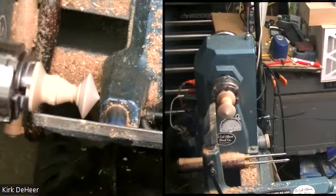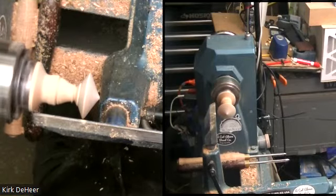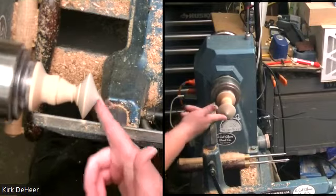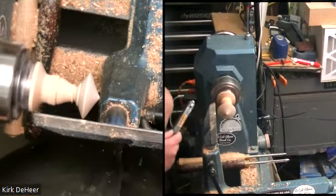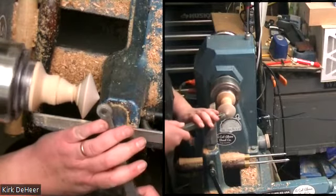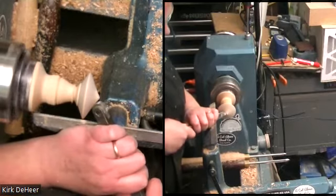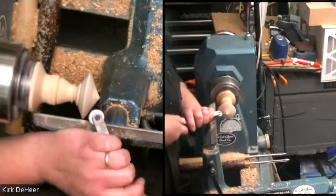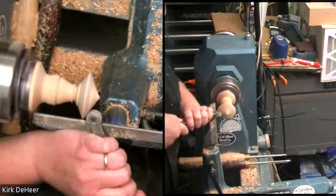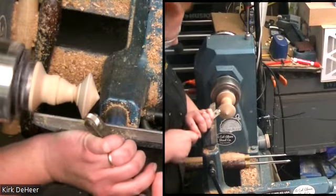I love the Wagner texture tool — I can do almost anything with this tool. We're going to speed up just a little bit to about 400 RPM to use this tool. 400 is extremely slow to me. The really cool thing with this is depending on how you hold the tool you'll get different texture variations. Depending on the angle you're holding the tool at, you'll get different texture and different patterns — and that's lots of fun.